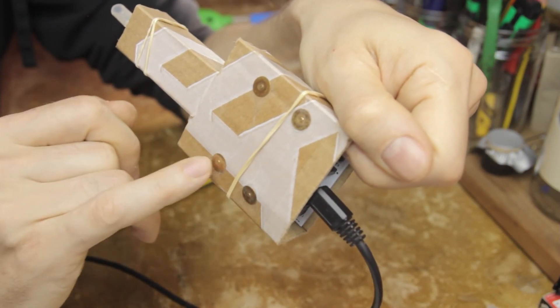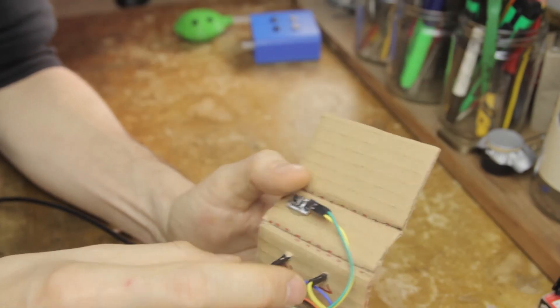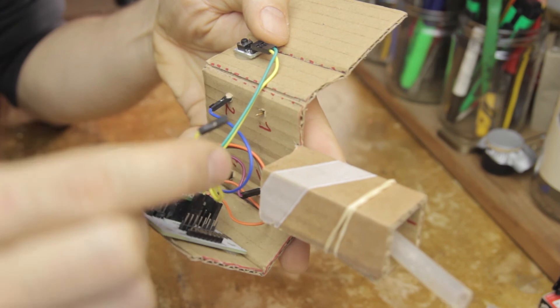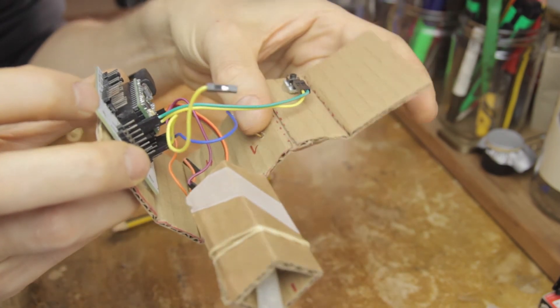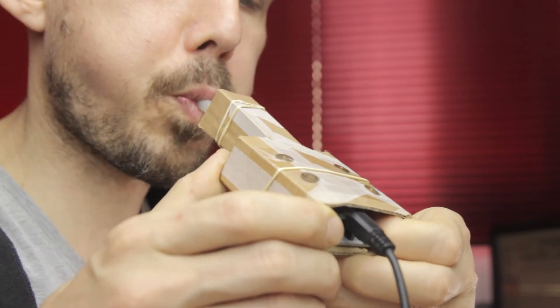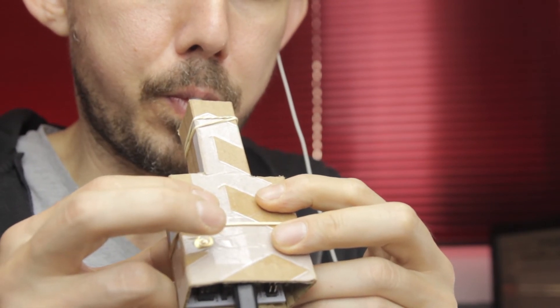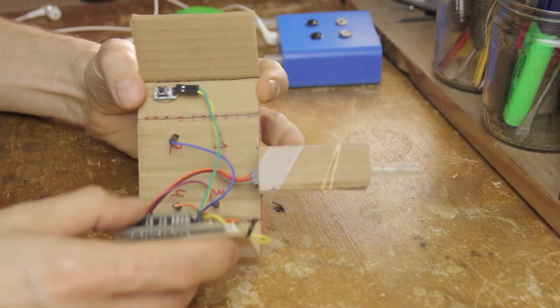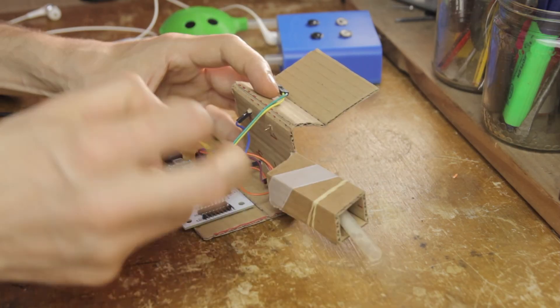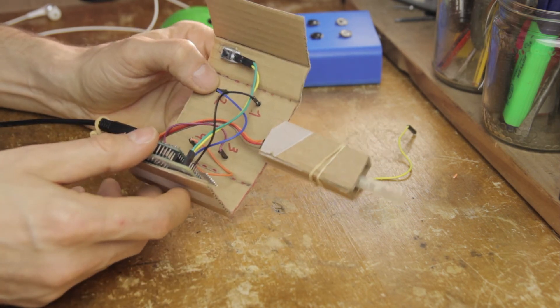About the keys — calibrating these right is important. If they don't work properly after calibrating, try adjusting how you calibrate; apply more pressure or less to see if you can find the sweet spot. If one of the cables isn't properly connected or is damaged, that's a problem you won't be able to calibrate your way around. Depending on which key is failing, it might affect even key combinations that don't include that key, so it's not always obvious what's going on. A disconnected key of course won't calibrate properly either, so you might get a noisy output from it rather than no signal at all. Make sure you check all connections thoroughly, even changing a suspicious cable for a new one if nothing else works. DuPont cables can sometimes be damaged or even come faulty from the factory, either in the header or in the cable itself.